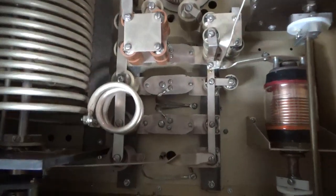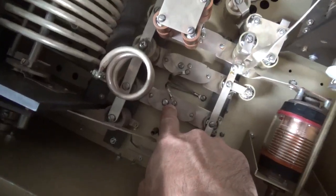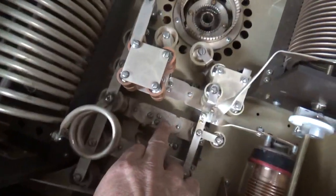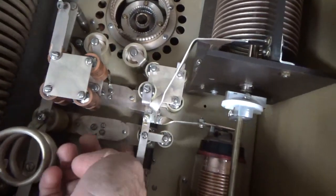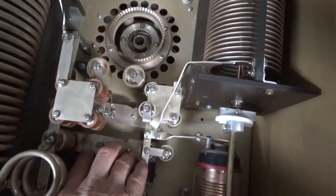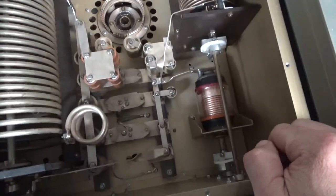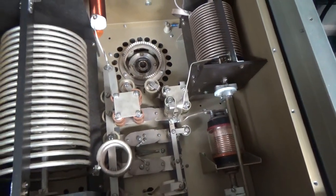A flapper can disengage — this one is actually missing one. These are controlled with solenoids; they're pulled down but don't always go straight down — they can be at an angle. The adjacent contact could either not make connection or it's a poor connection, so they add them in on the C1 and C2 side incorrectly.